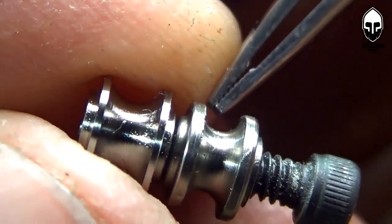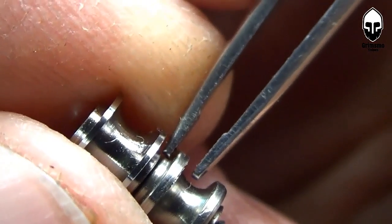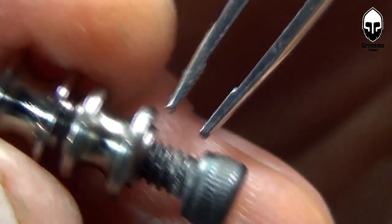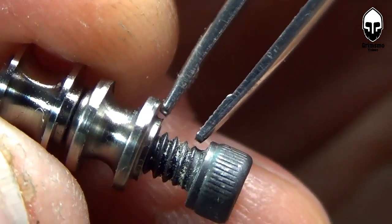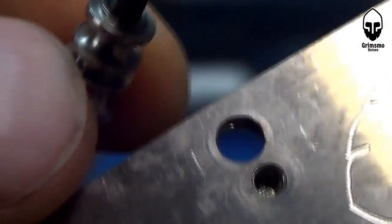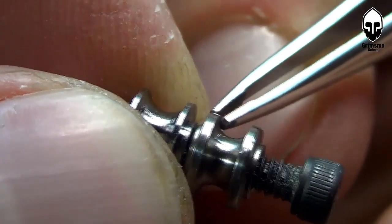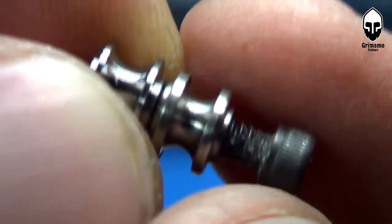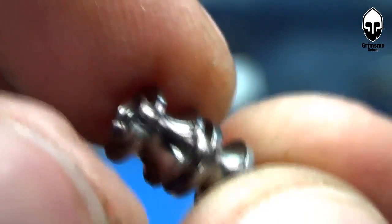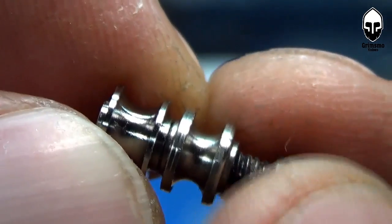We made six knives' worth the other day and sold them today. When putting the handles together using these spacers, I noticed a difference compared to the old ones — the knives are going together more consistently, smoother, everything just clicks together. Here's a comparison: I took two spacers, threaded them on a screw to hold them. The one on the right was made by a different shop, the one on the left is mine. The other shop used a really sharp turning tool instead of a straight grooving tool — they put a radius on the outside and a radius on the inside, and I did not ask them to do that.